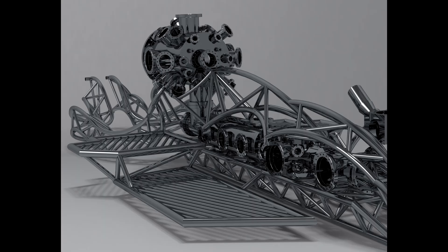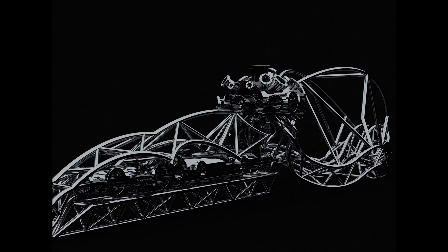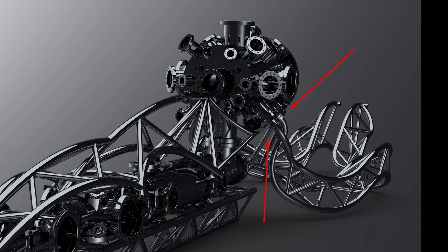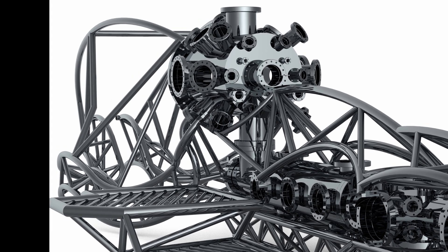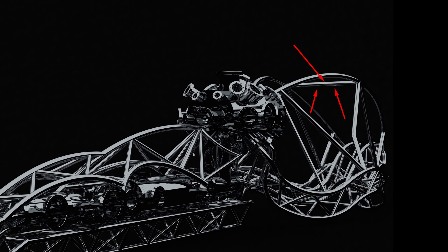Here's a rendering of the frame with floorboards. Floorboards were initially mild steel painted black to save material costs the first year — a little bit of a mistake because I ended up building it twice and buying stainless steel. That first year it was still a little bouncy in the middle like a weak trampoline, because the wheelbase is 20 feet long — a big distance to span between the axles. The rear truss wasn't sufficiently robust in the middle where it connected to the vacuum chamber. I fixed this by adding an arc from the rear of the truss to the top of the vacuum chamber along with some cross members, but the thing was still a little bouncy. You could see the arcs bend towards each other when you jumped up and down in the middle. This final bit of flexiness was remedied by adding a horizontal member up top connecting the middle of the two arcs. Suddenly the entire structure was just ultra stiff.